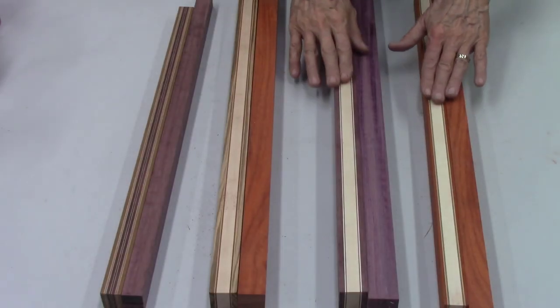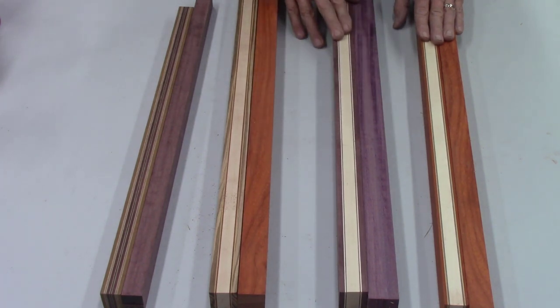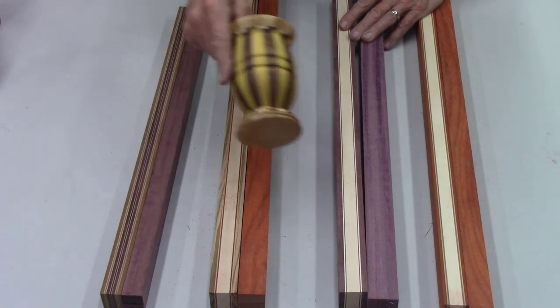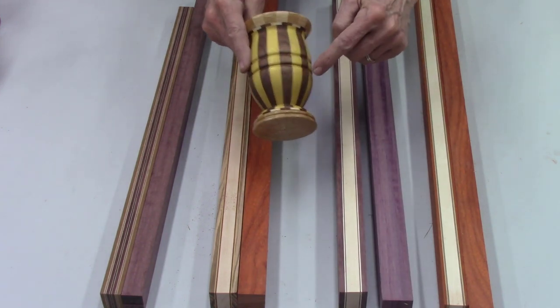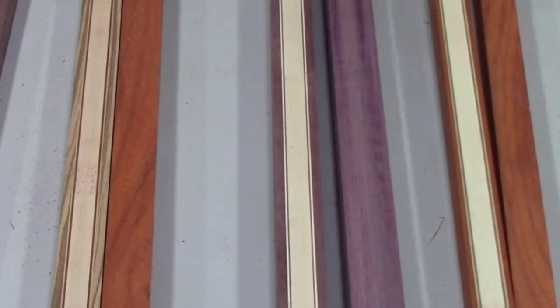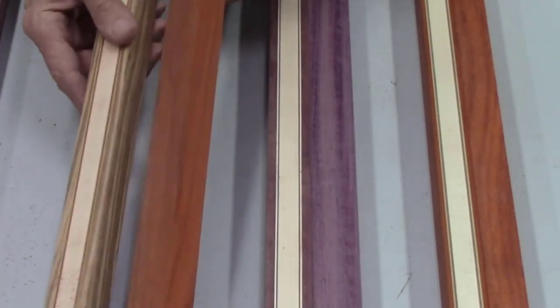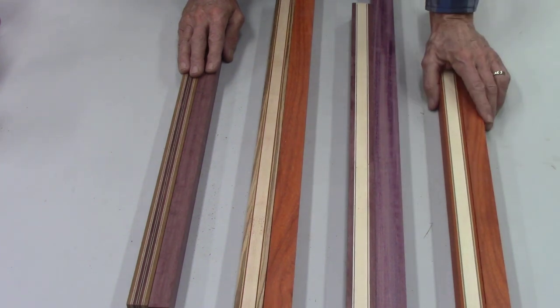My boards have all been glued up, run through the planer to get them flat and remove all the glue, and run through my board sander to get them square and parallel. I also made some complementary boards because I need 18 segments to make one of my bowls — I plan on using a solid piece of wood in between layers. Here's a piece of padauk for the padauk bowl, the purple heart set, the tiger wood set with padauk strip as contrasting wood. Now I'm ready to cut these on the AccuSlice system to make my wedges.